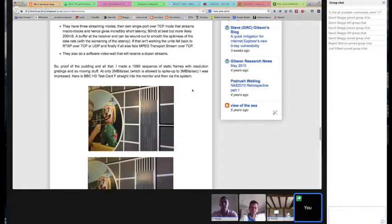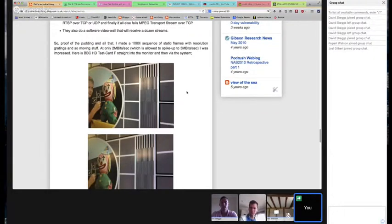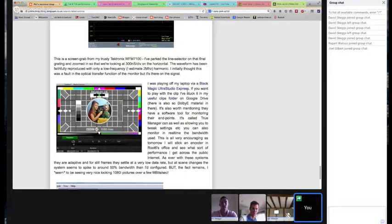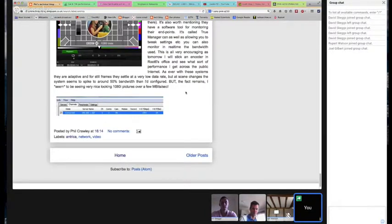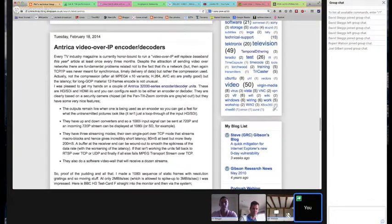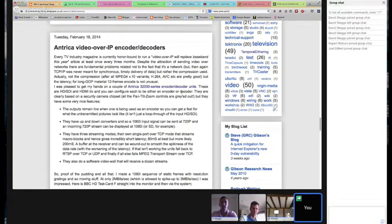And when you put it up against other manufacturers, like TeraQ, they have a complete MPEG GOP of delay, which is at least 12 frames, maybe 15 frames, so half a second. So it then gets difficult for people to make judgments and talk about it if you've got that bigger delay. And you think, if you are compressing these things very hard to make them work nicely over the internet, surely there is going to be a big latency.